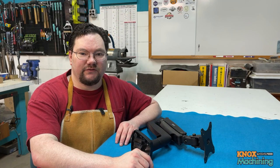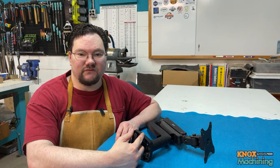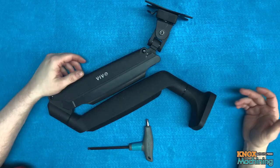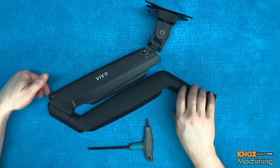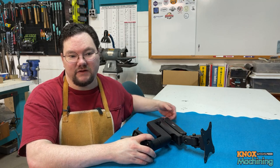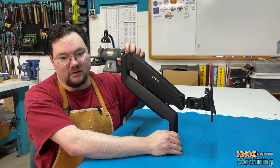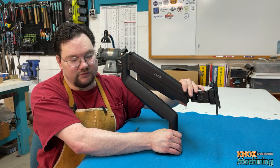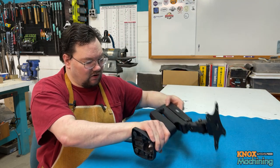Okay everyone, so to build the tapping arm, I took this monitor arm that I picked up off of Amazon, link to it in the description below. It's a Vivo brand. You can use whatever brand you want. Just make sure that when you get it, it has the adjustment for the gas strut right here. So this one has a screw right here that you can adjust to change the tension on the weight on the counterbalance here.